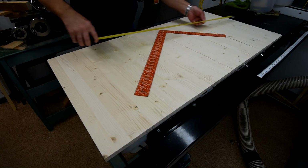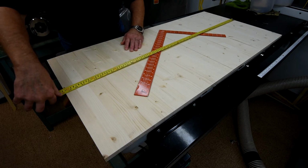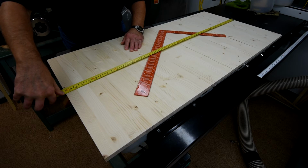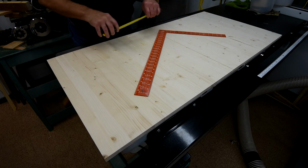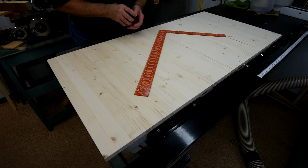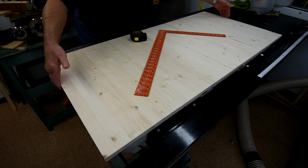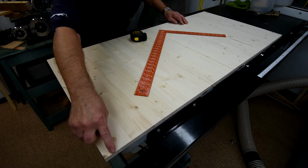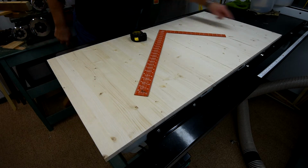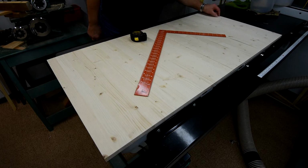Now you'll remember I said that the case had to be just under 48 inches long. It doesn't mean that it can't be smaller, it just can't be bigger. So I'm going to go ahead now and make the cupboard, or the case I keep calling it, and I'm going to make it this long, less 1/4 of an inch, because I am going to be cutting two cuts up the edges here and here, and the hinges will be mounted on here. Well, you'll see.